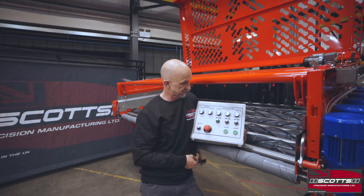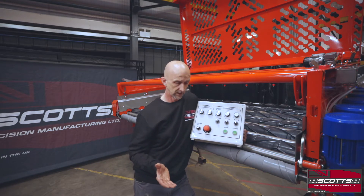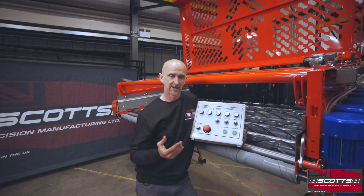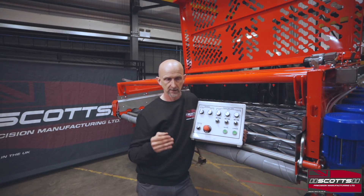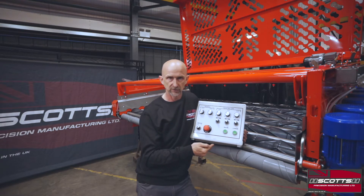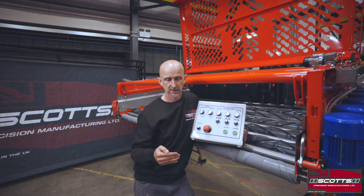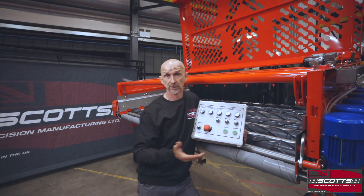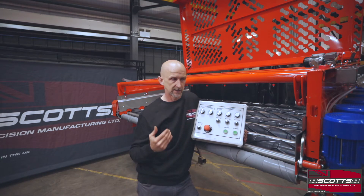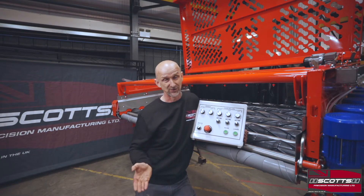The analog system has manual speed controls with potentiometers, reversing switches, and an emergency stop. Our other option is a PLC-based system which is programmable — a bit more expensive, as you'd imagine. The idea of the PLC system is we have a menu where we can save 10 parameters — 10 settings of speeds, positions and so on. Someone not working with the machine regularly can go to that system with presets ranging from extreme wet heavy conditions all the way to dry conditions where there's no cleaning needed. It's very good especially if you've got different shifts or multiple operators, but it certainly comes at a price.